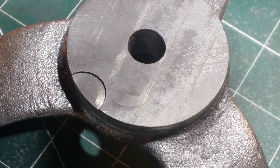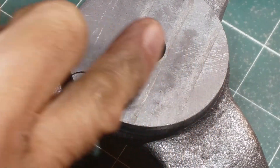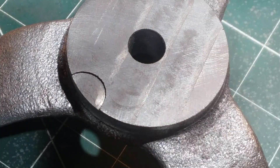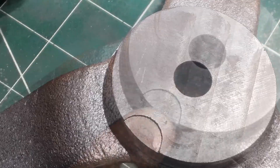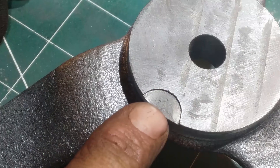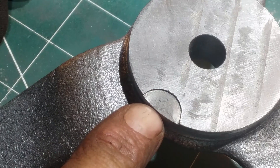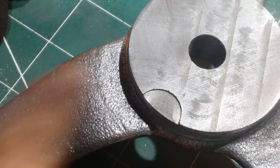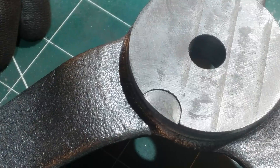This didn't come out too bad. I stroked a file across the top — there was a definite raised area on this face, and I think it's clear that the wheel wasn't clamped down sufficiently. There was just too much opportunity for it to waggle from side to side. Here's my little rookie error — an apprentice mark, I think they call them. I forgot to tighten the head and it pulled itself down, about half a mil. But it's usable.